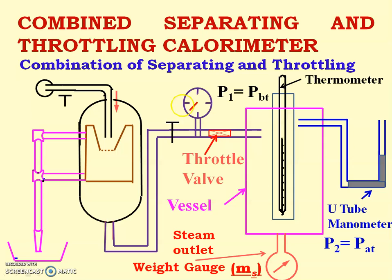For the working: the valve is opened initially, so steam enters into the perforated cup. Suddenly its direction changes, so water fills up below the perforated cup, which can be measured at the left-hand side. The separated steam, being lightweight, moves upward.